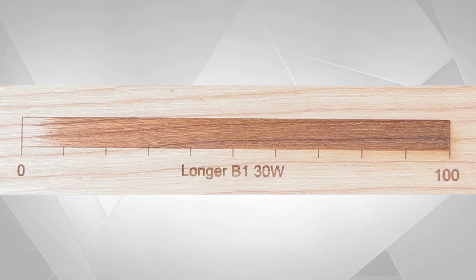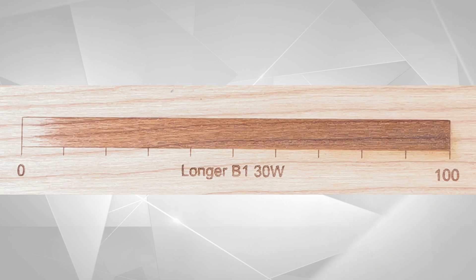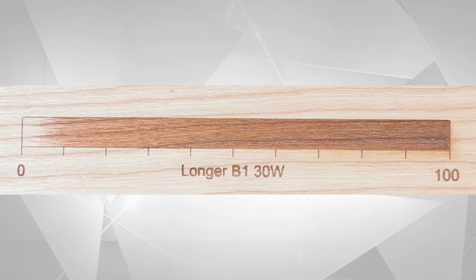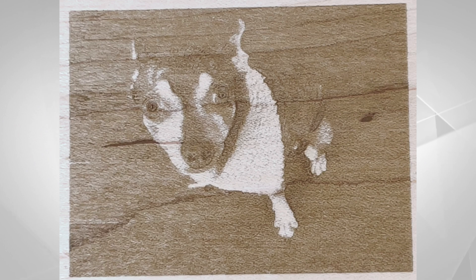On the engraving side, I didn't do a standard engraving test again — I was testing differently back then. But I did a gradient test, and if you look at it, I ran into a few problems because the grayscale on the 30 watt wasn't as good. You could see it was white and then there was almost no transition to black on the gradient. As a result, when I looked at the dog image I engraved there, I actually dithered the image because I was having this grayscale problem. So it looked like a good image, but dithering is kind of cheating. That laser wasn't really as good at grayscale as the 40 watt. So if you want to do high speed cutting or grayscale engraving, you're probably going to want to lean towards the 40 watt.